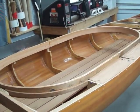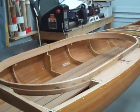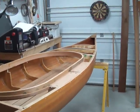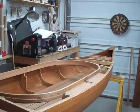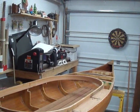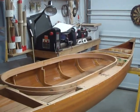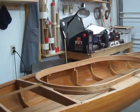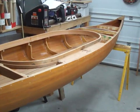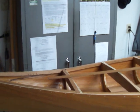The whole boat is made out of red cedar, except for the plywood ribs. Everything is Western red cedar, and you can get it relatively cheap. I got mine at a wholesale fencing outlet — they had quite a nice supply, including 12 by 12 beams running just under a hundred dollars, 12 feet long with hardly a knot in them. Really clear stuff. If you have a saw you can rip it down and save yourself a lot of money. If you have a large band saw for resawing, or know of a mill nearby that can cut it down to just a little over a quarter-inch thickness, you'll have all the wood you need to make one of these.